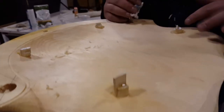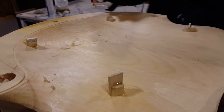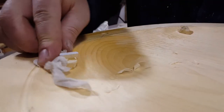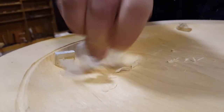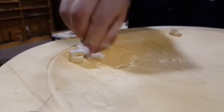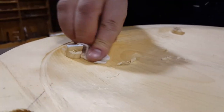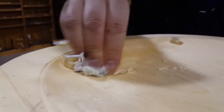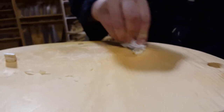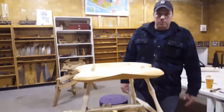Go ahead and wipe the glue off. These front ones you really don't have to worry about because those are pretty easy to clean up with the spokeshave afterwards. But these back ones are a pain in the ass, so you definitely want to wipe off as much glue as possible back here. See, these are in that curved region, so you have to use a curved spokeshave. You can only go so many directions and then it hits the end grain of that leg and it likes to mess up your finish there. So you've got to try to get this as clean as possible so you're not having to fight with glue later on. And that's all there is to it — that's perfect joinery right there.